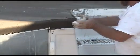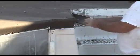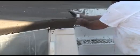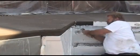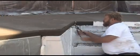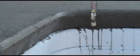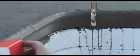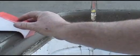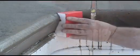Start from the end. Remove the form as you did the rest of the pool form. The plastic chairs can now be removed by pulling and twisting side to side. Misting the concrete with a spray bottle adds a uniform amount of water, making it easy to finish with a foam profile tool. This technique works well on jobs when a broom finish or even a tight trowel finish is necessary.